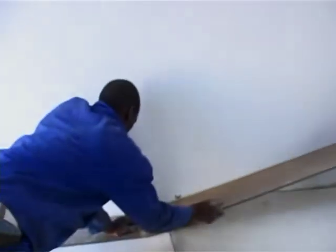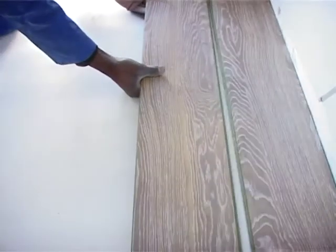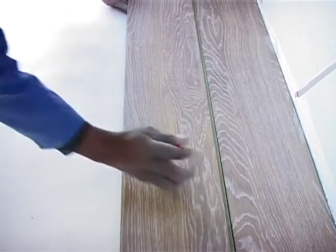This room is less than 8 by 10, so this room would need no expansion joints, barring the ones on the wall. So we can lay in this room, no problem whatsoever. Technically, we're 100% here. So, right, let's go. We hope to finish this room quickly. It's only a small room. It's a wide plank, click system. How much easier can you get?